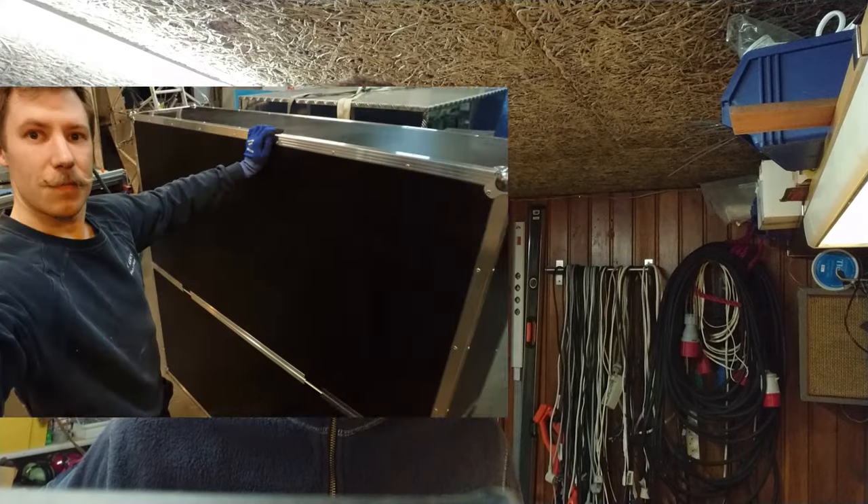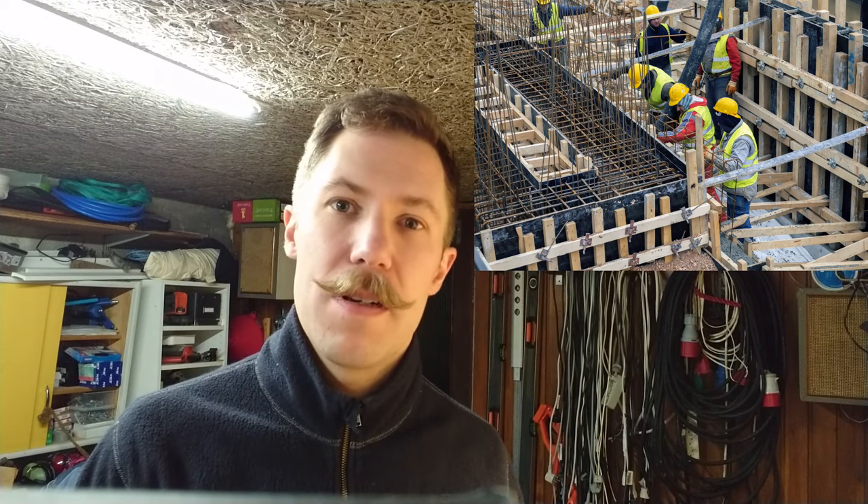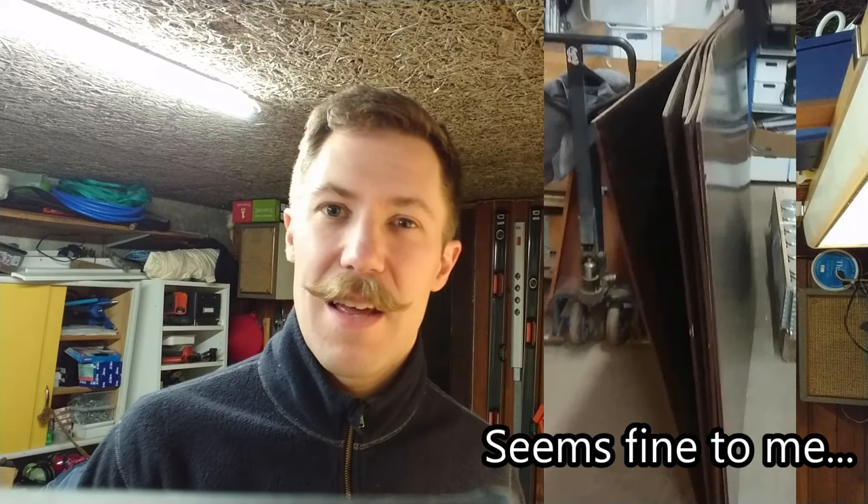It is also important that you build some proper flight cases and storage equipment for that gear. This will primarily be about using this kind of laminated in-situ concrete pouring plate. It's a laminated plywood plate, but it's rather cheap because it's made for concrete production of walls and other construction purposes. That has a few downsides — you won't get plates that are exactly level and they will bend in all kinds of directions. But let's see if we can overcome that, since price is also an issue.